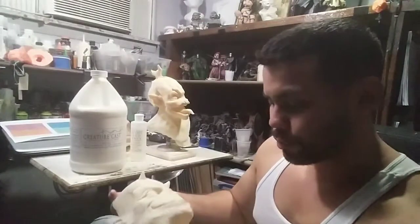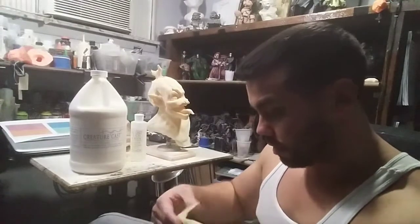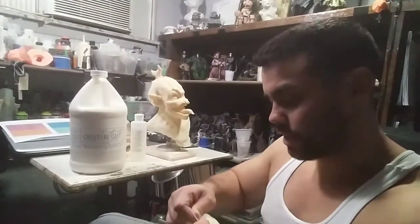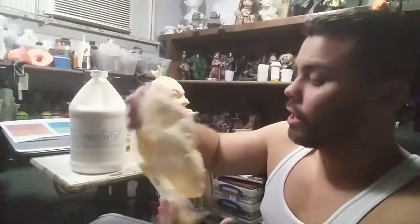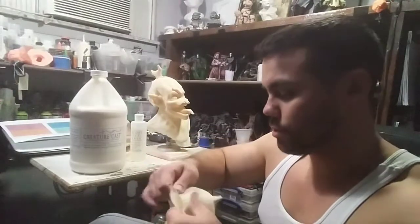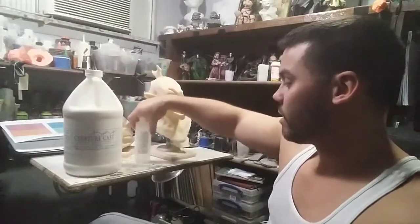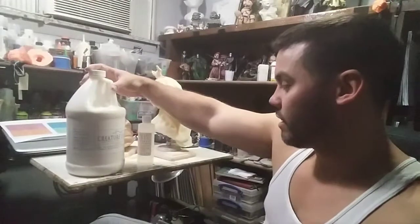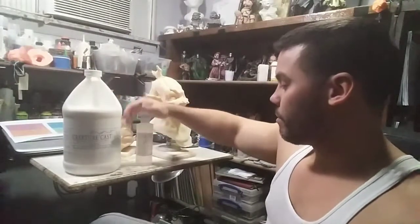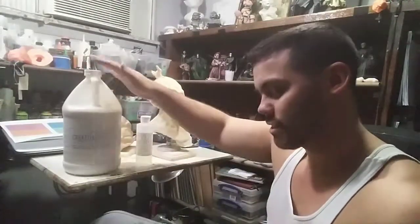But I'm pretty happy with the results of what came out. So testing it out was pretty fun, and I'm going to keep messing around with it to see what I can create. Honestly, I actually think the rubber is pretty nice. Just make sure that you mix up a bucket and do a thicker batch when you're casting for the Superflex. Mix in some thickener, that way you can get it to more of a latex-like consistency instead of the watery consistency.